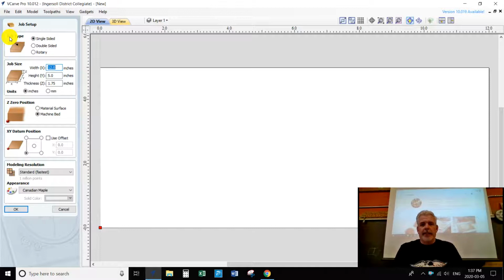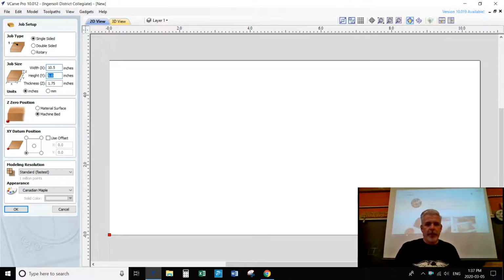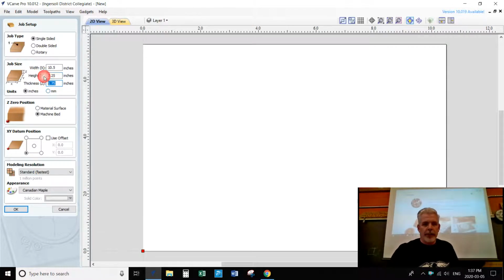I want to set this up to suit the material that I have. As I click New here, you'll see that I've got my piece up there. I'm looking at a piece that is 10.5 long. I'm going to hit the tab button and see it recalculate. This isn't new. And 7.25. You're going to get good at using your decimal equivalents as you design here. The thickness of my piece is 1 5/16. So 1 point, you look at your chart here, 0.3125 is 5/16 of an inch.